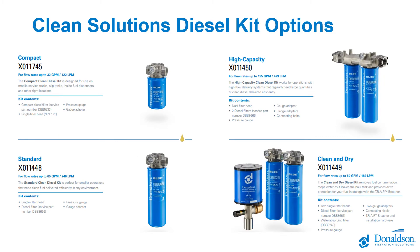Here's an image of the four different common kits that we sell. We sell a compact kit for small applications and tight installation locations. The standard kit is a standard particle removal kit, down in the bottom left. Upper right is the high capacity kit — it handles higher flow rate and higher capacity doing filtration on the dispenser side of a system. Lastly, we have a clean and dry kit for situations where you may have an ongoing water issue in addition to wanting to get clean fuel with particle removal. We do particle removal followed by a water absorber, and we have a trap breather that keeps particulate and condensation from occurring in the tank.